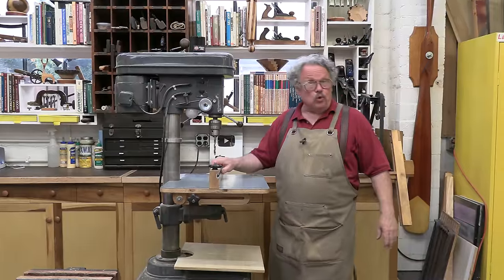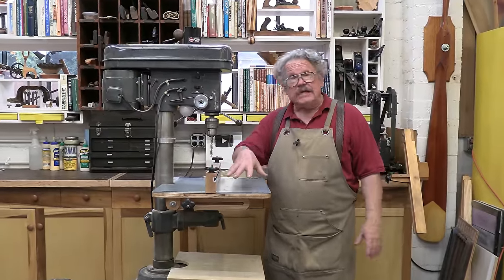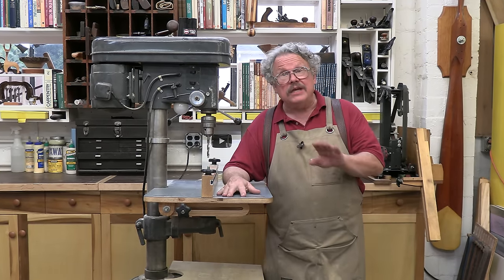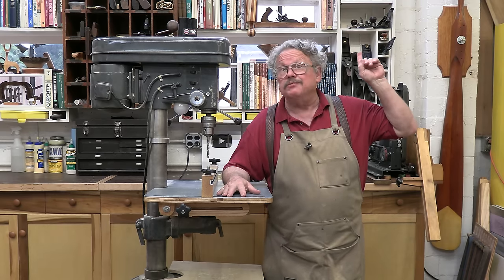You can, if you wish, make pocket hole joints without pocket hole jigs. You simply need a tilting table for your drill press and a sturdy fence. We have the plans for both, and I'll leave the link in the description, or you can click on the one that's hovering over my left shoulder.